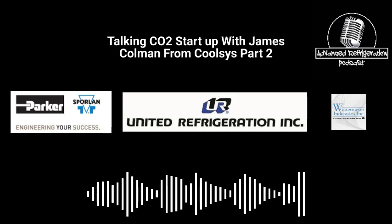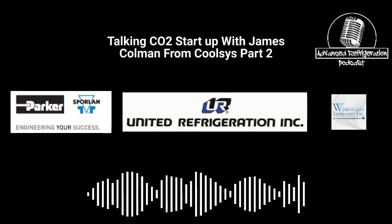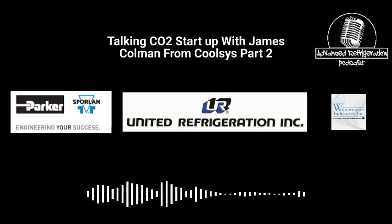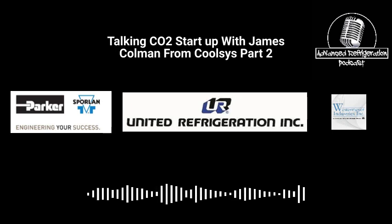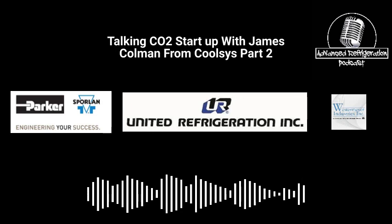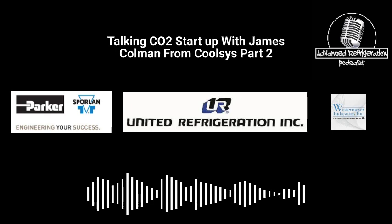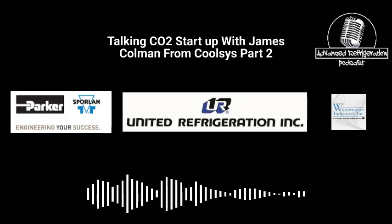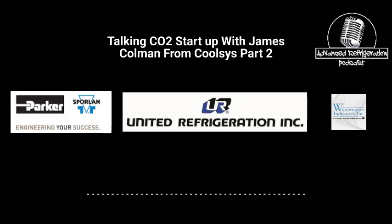The update rate on the VisioGraph is faster than the E2, so I will use that. When I'm first starting up compressors - usually when I'm above my triple point adding liquid - I'll run the second compressor and watch that Visio screen because the update rate is quicker and I can see in real time what my pressures and valves are doing. That's one of my favorite things - starting the first compressor.